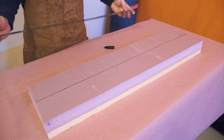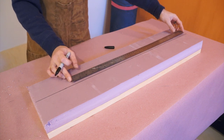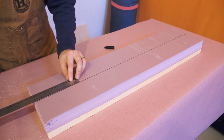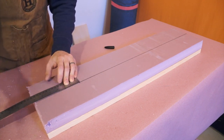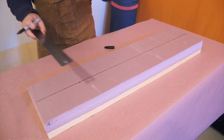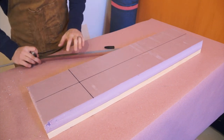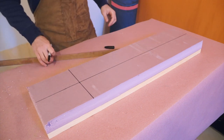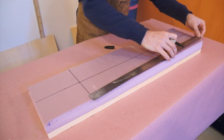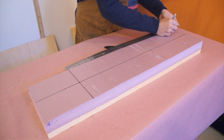I want to have a kicktail. Let's figure out a rough idea of where we want the wheelbase to be. If we're doing a mini cruiser, let's do a six inch kicktail. We'll mark six inches here and six inches here. You could do this with a square if you have one, but I do want to show you that you can do this with a pretty minimal set of tools. This line is going to be where our kicktail starts — we're going to cut the kicktail out of this side. I want a little tiny nose scoop thing — we'll do two inches for that. It's going to be so subtle in the final product, but with a little luck you'll be able to feel it and it will make for a better board.